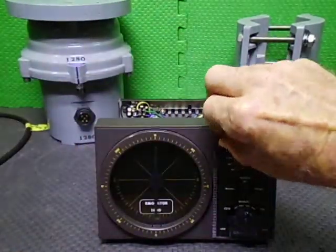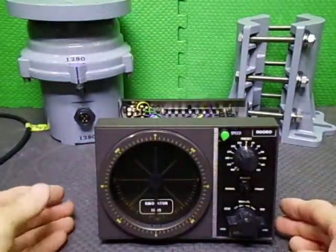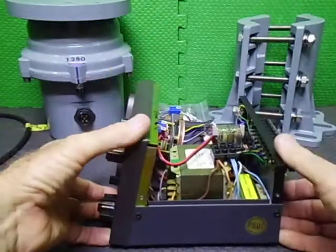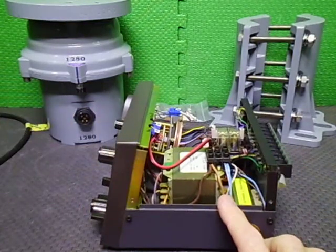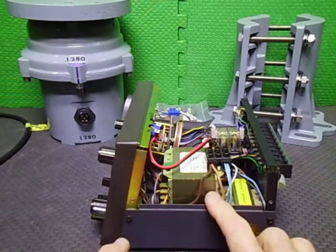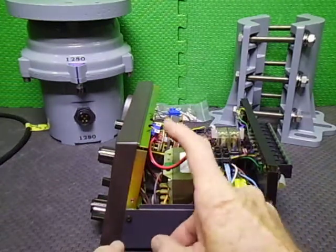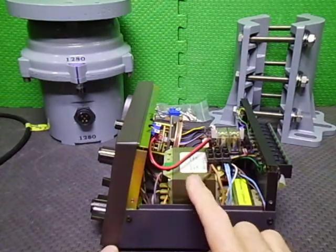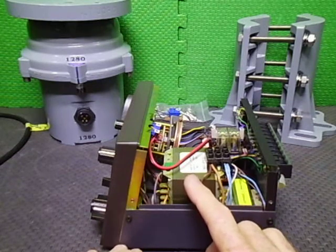We have dial speed control up here in the top corner. The controller was originally a dialer CR4P. The transformer was removed because that was for an AC rotator. I had a new Australian-made transformer to get the voltages to the right level to run into the speed controller, which can only handle 35 volts DC input. So I need to change the transformer to keep that down under about 33 volts offload.